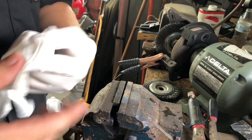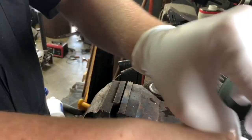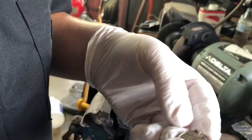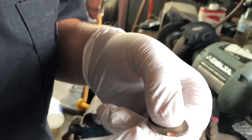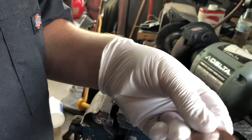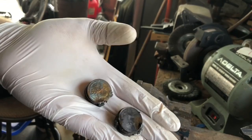There was a minor accident and I got a little flustered — part of what happened was I blew apart the billet I made. However it does demonstrate kind of what we're doing. There's where the welds stuck and then tore apart part of the quarter. If you look, the core of the quarter is copper, and then it's just coated in this silver nickel substance. And that's what creates the pattern when we forge weld it and spread it out — the silver is the coating, orange is the core.